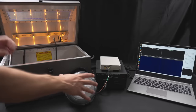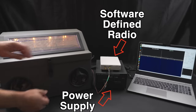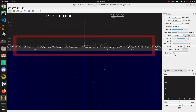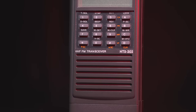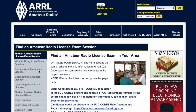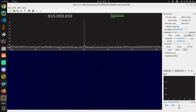Let's take a look at the radio frequency transmissions coming from this meter. Here I have the smart meter set up next to a software-defined radio and a power supply. The power supply takes the 120 volts coming in from the wall and steps it up to 240 for the meter. The software-defined radio will let me listen to any signals being transmitted from 902 to 928 megahertz, which is a license-free band in the United States — meaning anyone with an FCC-certified device can transmit here for free. There are other bands where a license is required, such as the 144 to 148 megahertz amateur radio band or the 800 megahertz cellular phone band. Cell phone bands cost billions of dollars to acquire the rights to use. Those little blips on the waterfall are the smart meter sending a signal, trying to report information back to the power company.